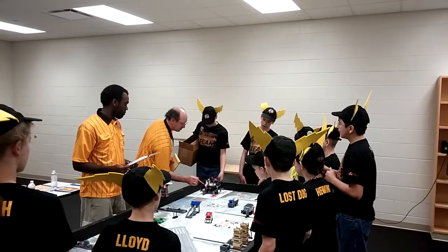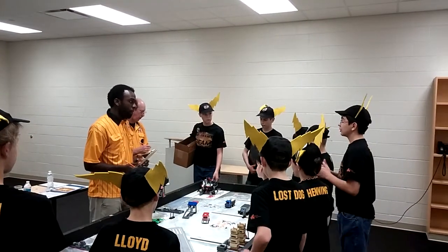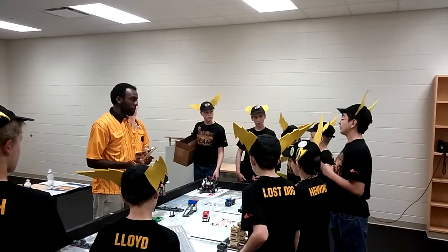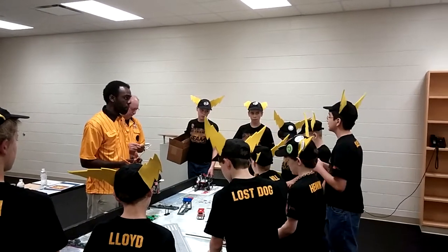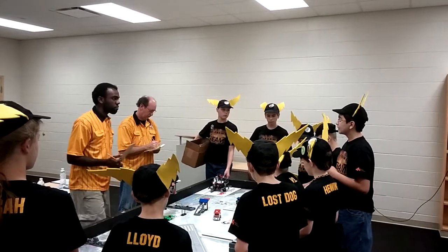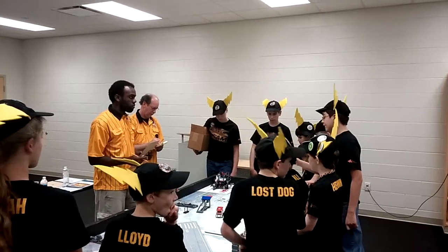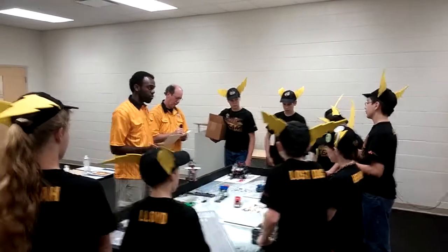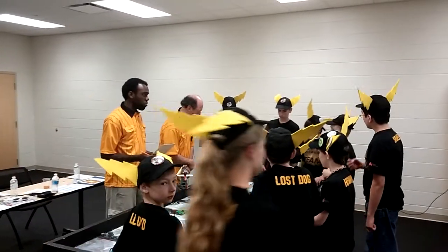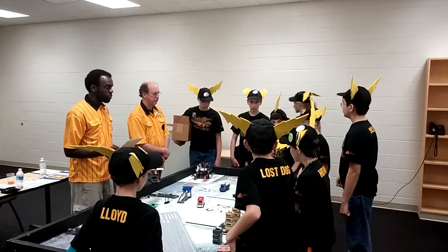So you got 2 sensors here and here, is that right? Yes. The treads work great, but when they turn, they can sometimes slip, which is why we have the gyro. The gyro helps the robot turn more accurately from side to side, and the light sensors help the robot detect lines on the board by seeing them and then sending a signal back to it, and then it can turn. And I want to introduce you to Sam and Zach, and they're going to tell you more about the robot.